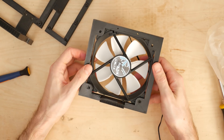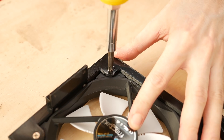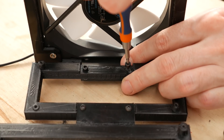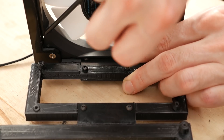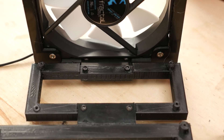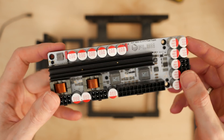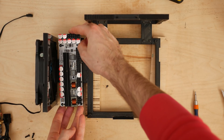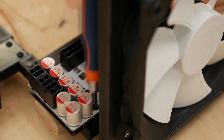First I attached the fan to its frame, which had to be removed in order to access all screws. The fan piece had to be fixed on the other side of the neighbouring power supply frame because the originally designed shell was a bit larger. After implementing Plan B the inner dimensions shrank by centimeters, so the entire frame assembly barely fit in. For the power supply I once again reached for the HD Plex Nano ATX — it's not the cheapest option but it's incredibly small and convenient when designing custom small form factor cases.